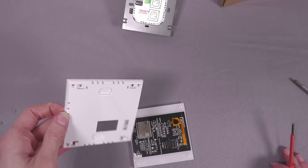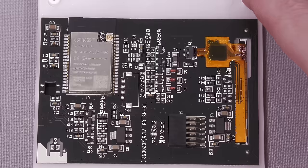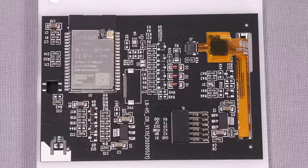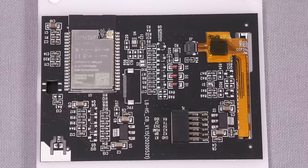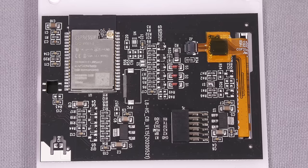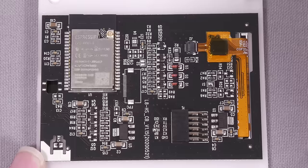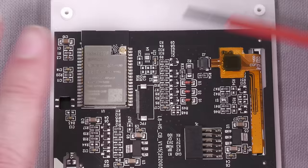Interestingly they've put an external antenna on the case for better signal, but there is also a PCB trace antenna on the board too. Now here we can see the inside, and what you'll notice is this is really really simple — there's not much going on, which makes it easy to work with custom firmware. Compare this to products like the Sonoff NS Panel which has a separate HMI display with its own microcontroller, meaning you've got two different microcontrollers to flash with firmware. With this it's dead simple.